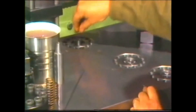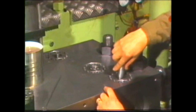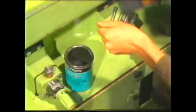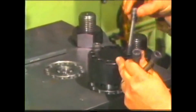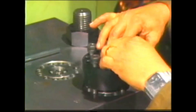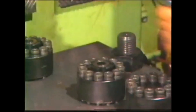Don't forget the springs when reassembling. Check the contact surfaces on the fuel pumps and covers once more. Grease the screws with Molykote G paste. These Allen screws are tightened evenly and crosswise in stages to 60 newton metres.